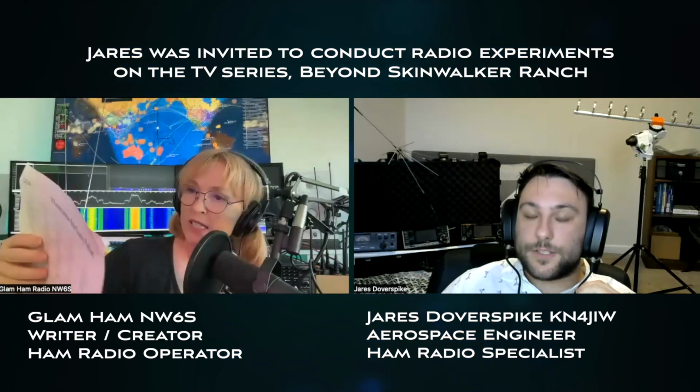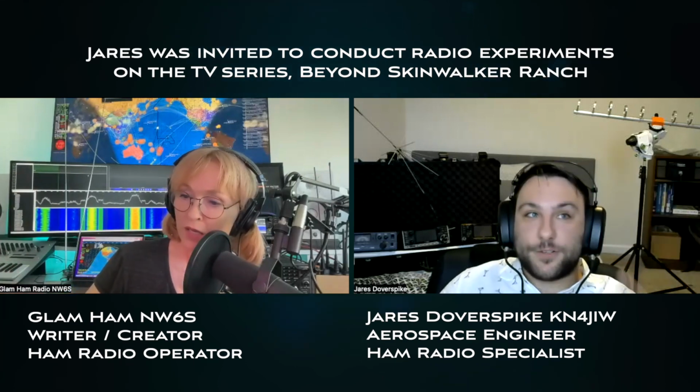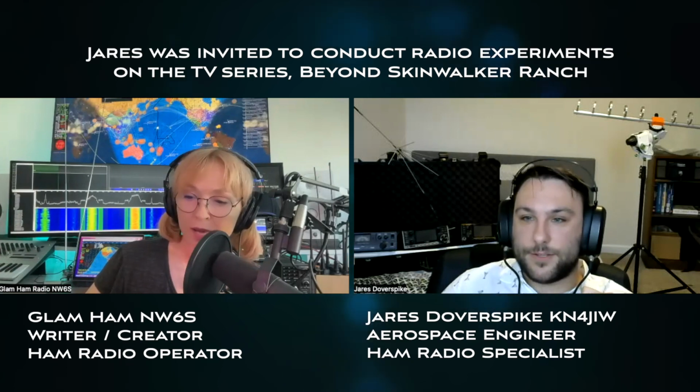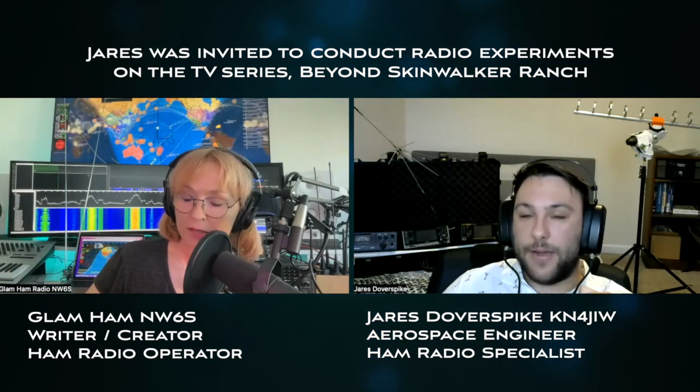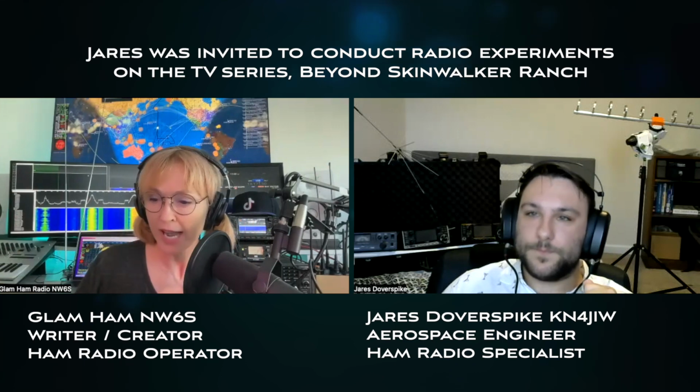Yeah. Yes, actually, now I remember. You are allowed to transmit on 23, but your license will determine the amount of power that you're allowed to transmit with. Okay, that's going to be the limiting factor, the amount of power. I know you're 200 watts for tech and gen, I believe, and then 1500 in the US for extra.